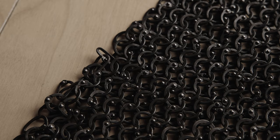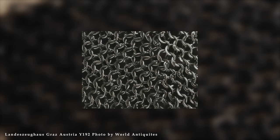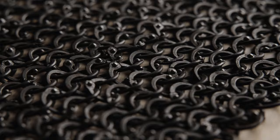Paul Dullis from Germany made rings that aren't too different from Asher's. He used slightly thinner wire, flattened his rings a bit more, and made very small and precise overlaps. He wants to be compared with rings in 16th century mail capes — specifically this one. And I call this a success. Three points for Paul.